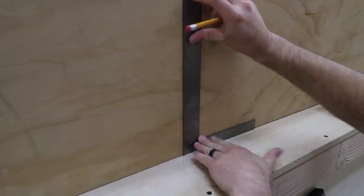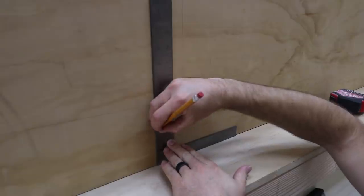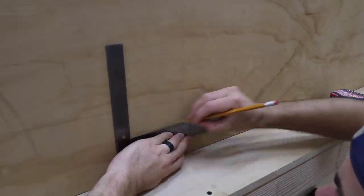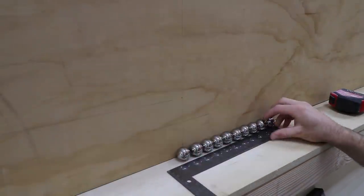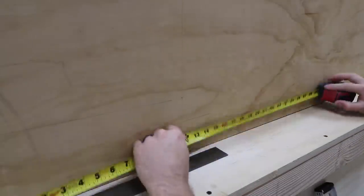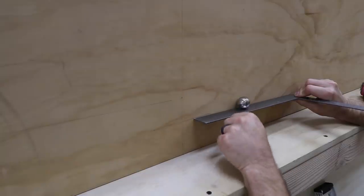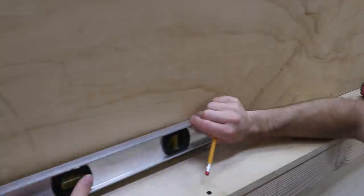In order to get them to cross over paths, they have to drop an entire pinball height plus the minimum thickness of a section of track, so drop 1.5 inches down. That flat line is the bottom of the new opening where they'll pop back out. From that spot, I then drew out the scoring ramps that will live on the outside of the machine. They need to be long enough to hold 10 pinballs in case someone is really good and sweeps their not-so-competitive competitor.